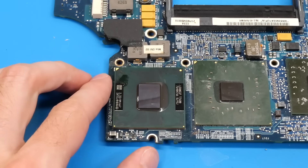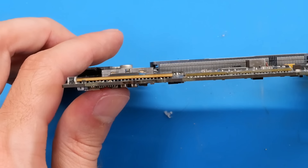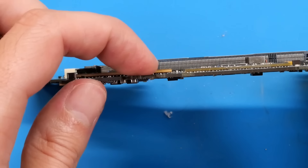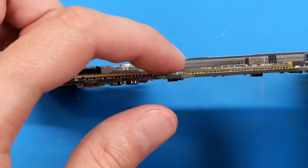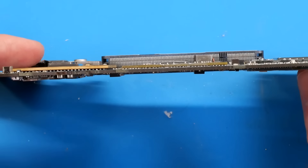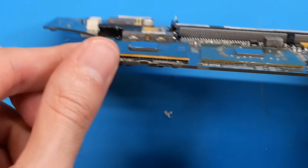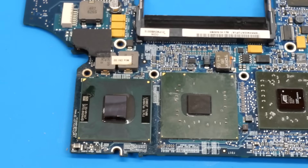There we go — got it right there. You can see it's a little bit raised; that's just because those tinned pads are pushing up on each of the solder balls. Now we simply need to get the hot air aligned once again and heat it to solder it into position. And just like that, the chip looks to be soldered on successfully — you can see it drop right as I began heating it. So let's turn the hot air off, turn off the board preheater, and let the board cool down. Then we can get this board reinstalled back into the chassis and give it a first power-on test.